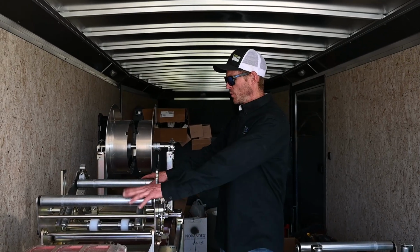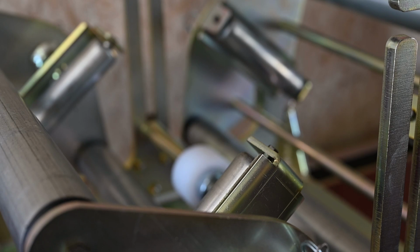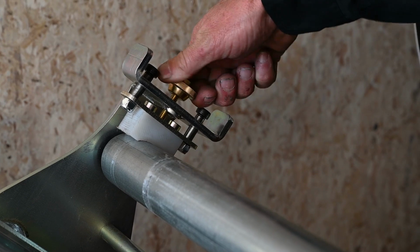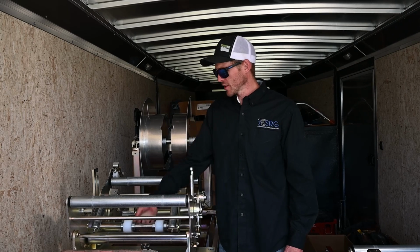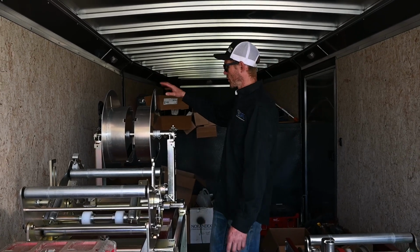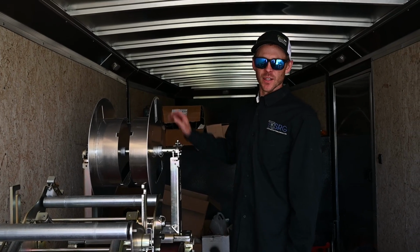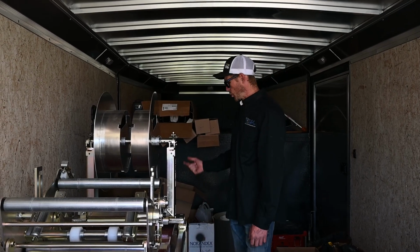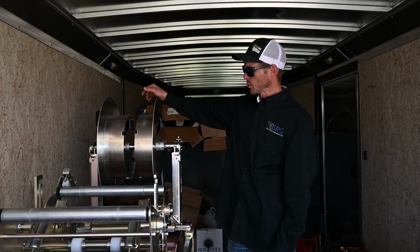So I got this machine with a coil cradle. This is a full-size coil cradle. It's really nice because it has a brake on it, which is different from what I'm used to, which I'll show you next, and it has a stabilizer for the inside of the coil so the coil won't unravel or anything. Works really good. And then I can just feed this over the spool, which they actually require you to buy with these machines because that helps it feed into the machine correctly. So it's nice to be able to just set small coils on here and feed them over that spool and in. And the stuff that I use a lot of, that I don't have to move in and out, I can put on this spool and just keep it on there.